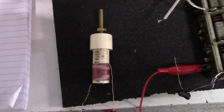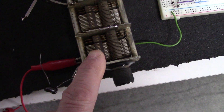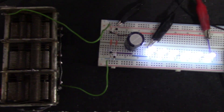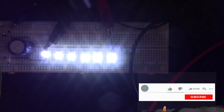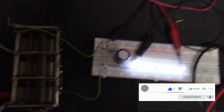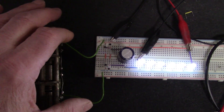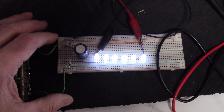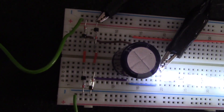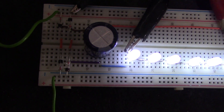There's the L, part of the antenna tuner — there's the L input and there's the capacitance to ground. The output — these LEDs are actually bright enough that I can't really look at them for more than half a second. Here's the tuning in the LC network. Out of that goes into the diode bridge — four of those 1N4148s, about 10,000 microfarads of filter capacitance. And here's the diodes.